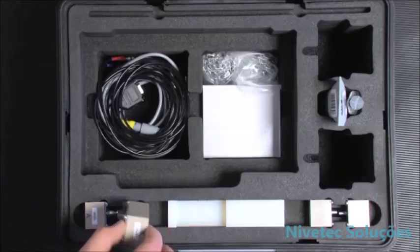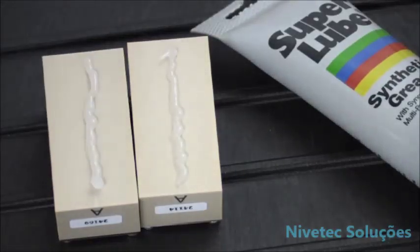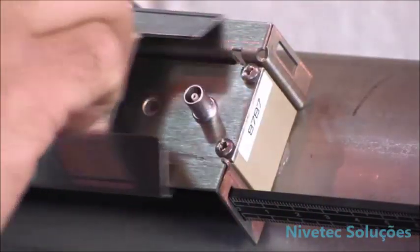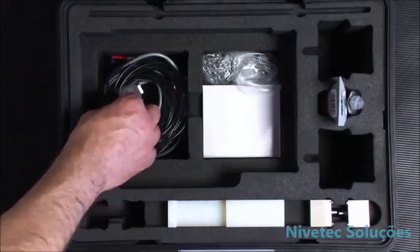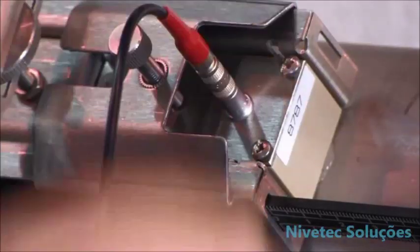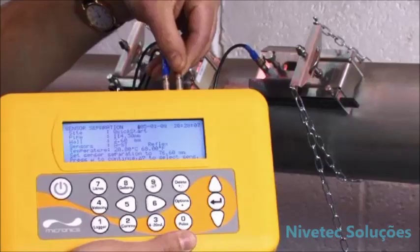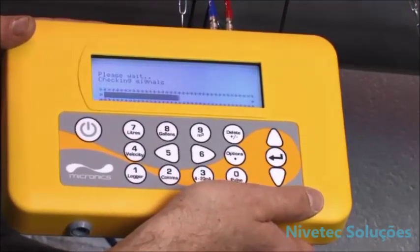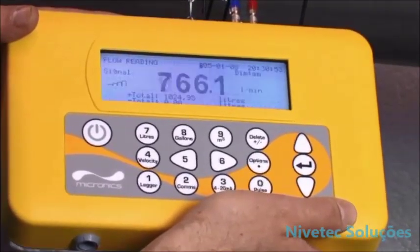Take the two appropriate sensors and grease each one on the face. Then insert each sensor into the guide rail and fix in position by tightening the screws. Once the sensors are installed, connect the blue cable to the downstream sensor in the flow meter and the red cable to the upstream sensor. The successful installation of the cables and sensors means that once you press the enter button, the flow meter will search for the best signal and begin to measure the flow.